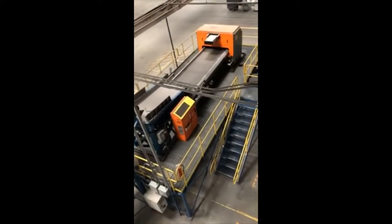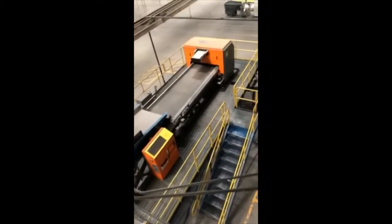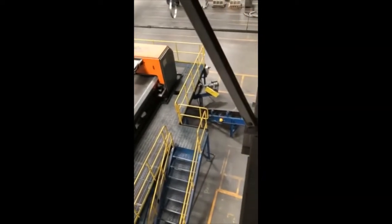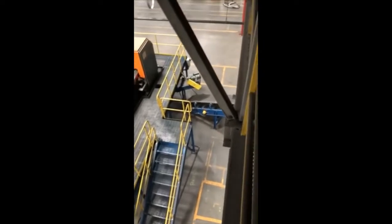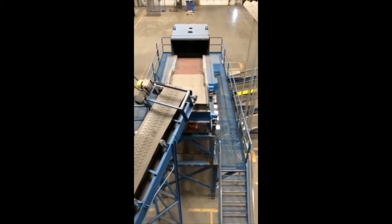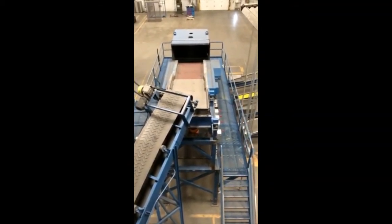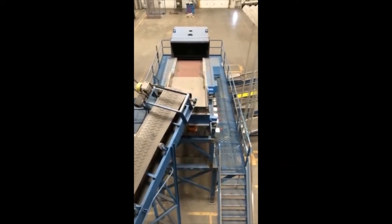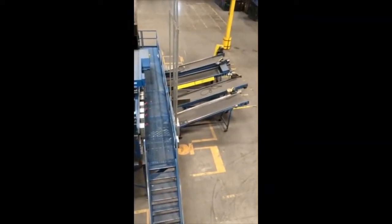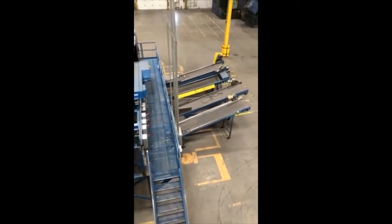This is the Titech CombiSense, which you train to go after color and shape. And so it would remove the circuit board, and then what was not circuit board was aluminum and stainless, and that would go off here to the right and up through a Huron Valley eddy current separator that would remove the aluminum and stainless. And then there'd be some materials that had to be put back through the system. These are the takeoff conveyors that would take the material out from underneath the eddy current.